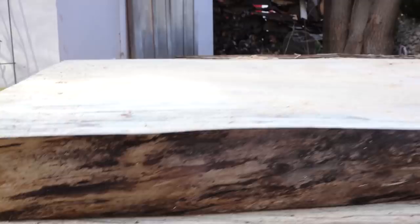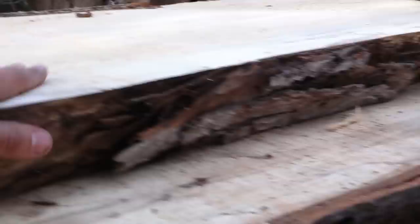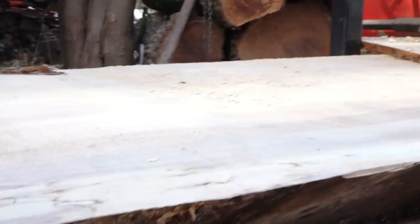It's got a bit of a dip here where it got back into the wood. As it was unsupported on both sides of the cut, the blade rose a bit and then it got into all the wood and then it righted itself out again. So it's a little low here as it's trying to reestablish its course as it gets through being supported versus unsupported. You can see the same thing going on over here. So that's what it is, I guess.